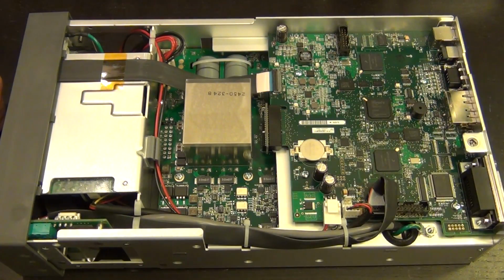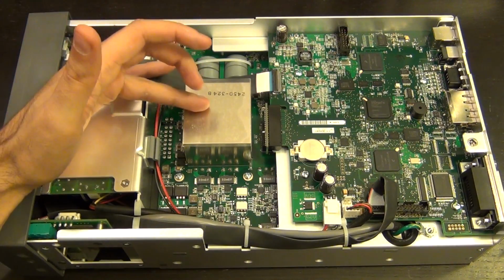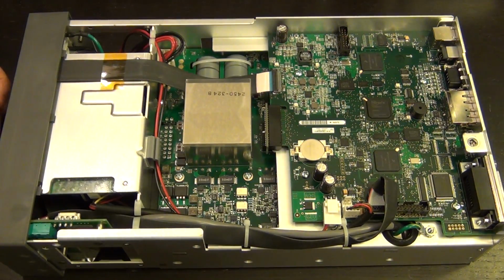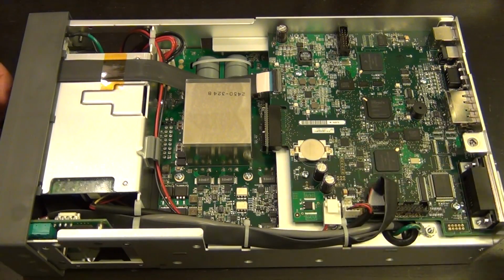So you have this 90-degree transition done this way by using two of these types of connectors. At the center is a very large shielded component. Now there's several components underneath here, some EM sensitive components for measuring perhaps, or some reference or something, I'm not sure. This doesn't come off, and you can see some 50 milliohm resistors on this board on this side, some optocouplers and so on.